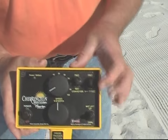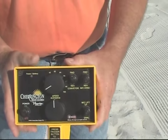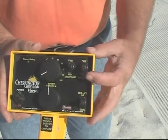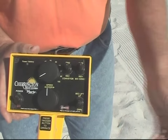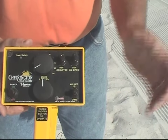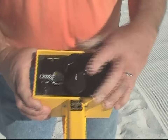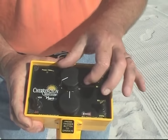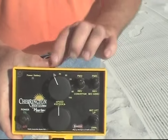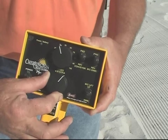Once you are ready to begin, turn your conveyor switch to the forward position, starting your conveyor. Next, make sure that your drive direction switch is in the forward position, and then lower the digger point so that you can begin operating. Press the operate button and begin operating. Once you begin moving, you can increase your operating speed to about the 30 to 40 range marked on the hand controller unit, and use your steering control to carefully and smoothly steer wherever you need to clean.